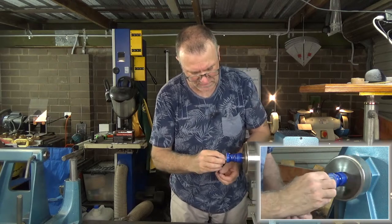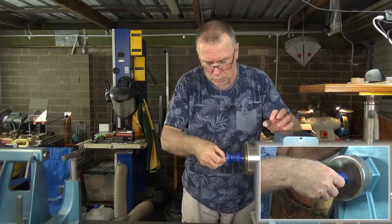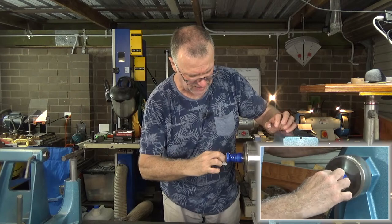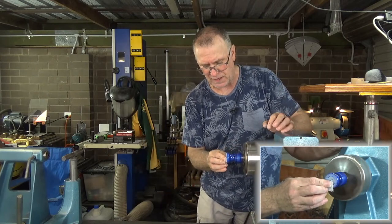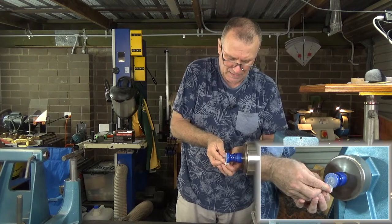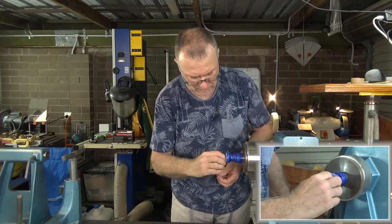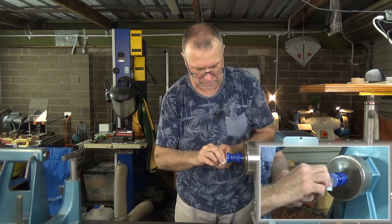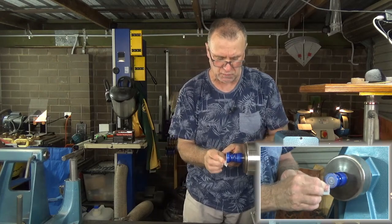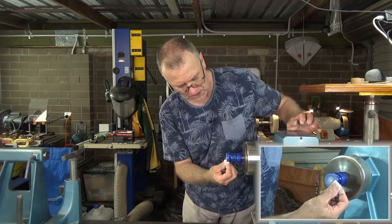The only thing I can't say for sure one way or the other, to be honest, Brett. But when I read the manufacturer's or supplier's information about the particular resin that I'm using, it mentions that if the resin doesn't cure properly, it's generally a sign that there's too much hardener being added, or an incorrect amount of hardener. So I've got a funny feeling that my cup might be slightly out with the measurements on those last ones we cast, because they were all a little bit soft. And whilst we've managed to harden up the other ones, that one has stayed softer.